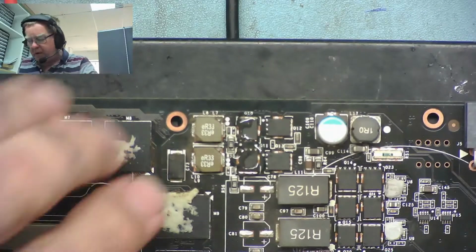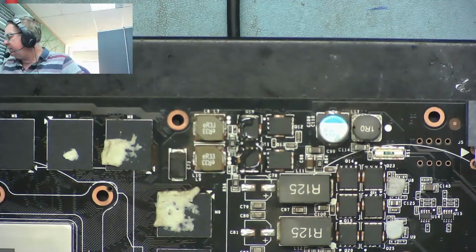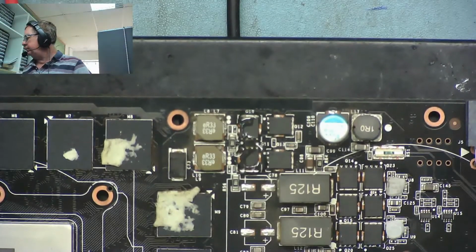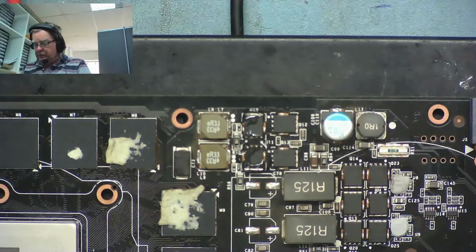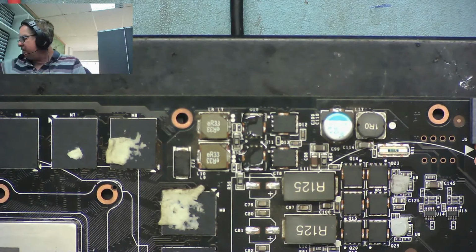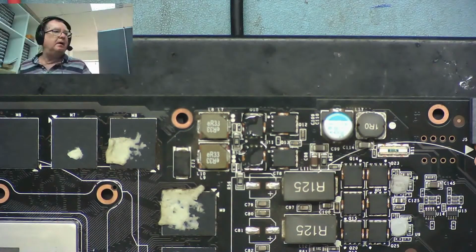There's a couple of components right down here, but I'm hoping my trick of actually getting some heat in by effectively putting some leaded solder on the FET will help here. Having said that, there's no doubt a big metal pad underneath these as well, which doesn't help.